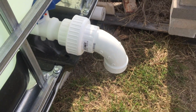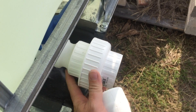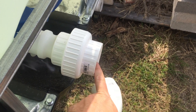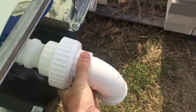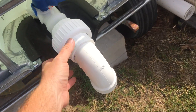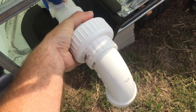Here's kind of what I'm thinking. I've bought a slip union and a threaded union, and then I switched one piece so that it's a slip-threaded union. That way if I ever do have to do anything to this and take it apart, I can get this off and probably bend it around enough to get the tank off of here for maintenance. Otherwise this would be pretty stuck — if I just solvent-welded everything, this would never come off.